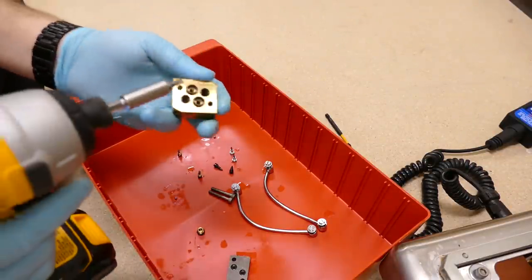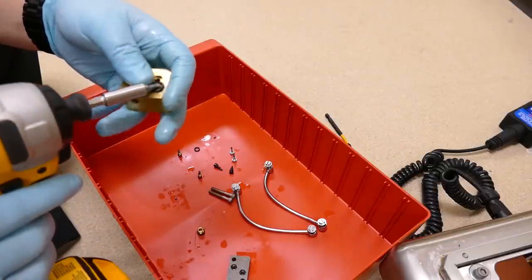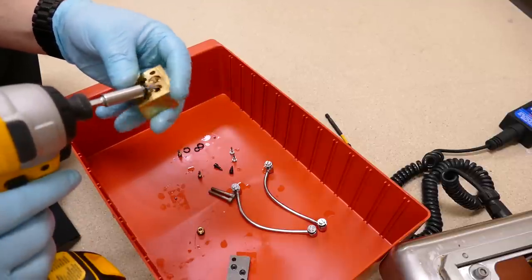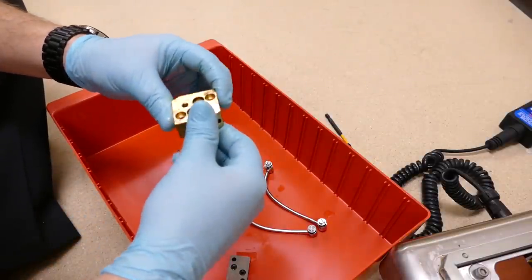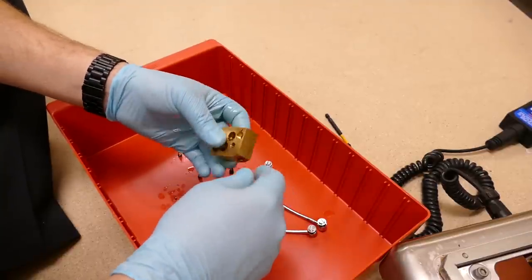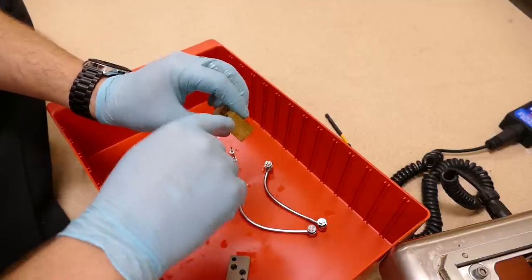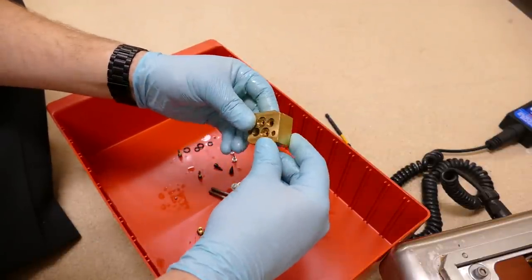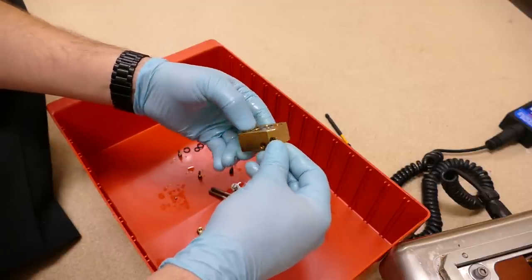The very last thing is to pull these o-rings off and sit them in the bottom of the tray — four o-rings total — and that is a fully stripped-down block. Now we're going to wash it out with soap and water, then take it to the med air supply and blast air down through every channel. I'm going to re-inspect it with a flashlight to make sure I can see light through the other side of each little opening, ensuring no debris remains, and then we'll put it back together.